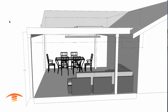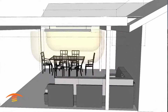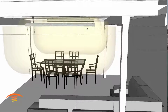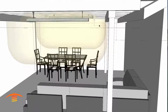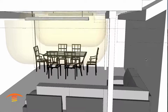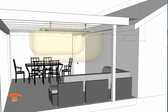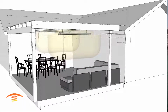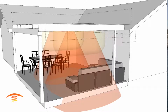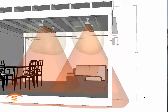Go back here, but that would be the only way that we could actually move the heater to the right further. We still have the 6 inches of clearance above that we'd have to deal with, but it would give us about a foot of coverage further over, but it would be awfully hot coming down another 6 inches roughly. So anyway, let me just go back here, put that back up there, and now we have it reset.